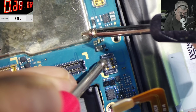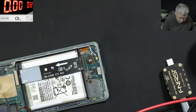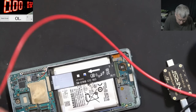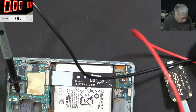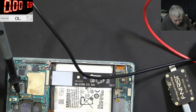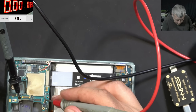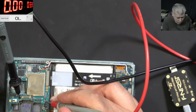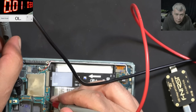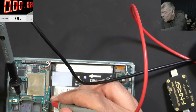And here is taking 300 milliamps. Check that, check on the screen. So something is bad if it's taking 300 milliamps. With 3.2 volts, it's taking 300 milliamps. That's not okay. I need a ground. Thermal camera. So here, now it's not taking. Now it's taking like 10 milliamps. That's crazy. Probably it's that short, which I couldn't find.